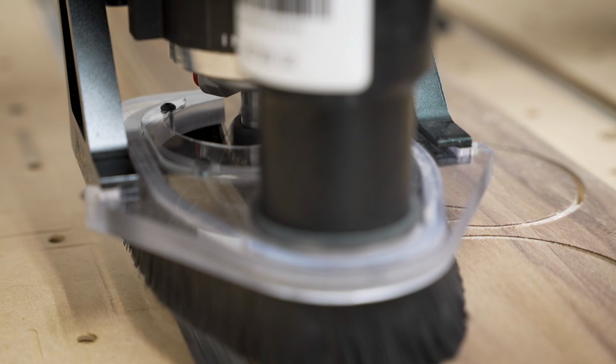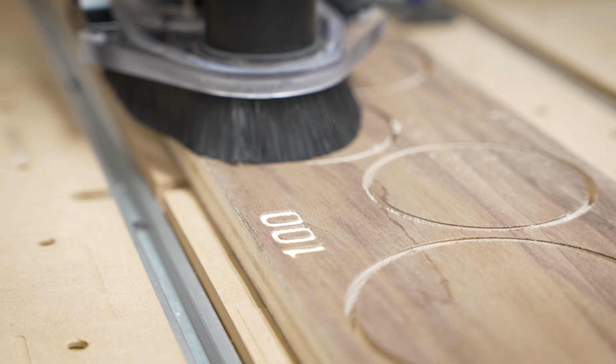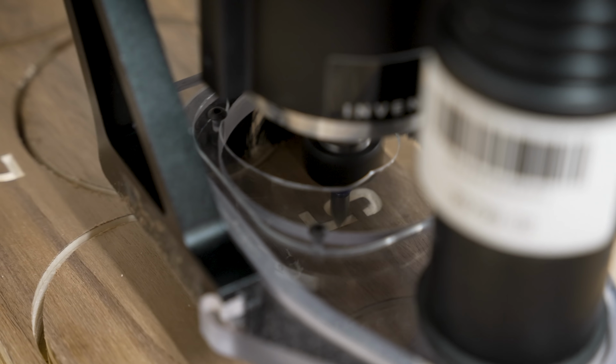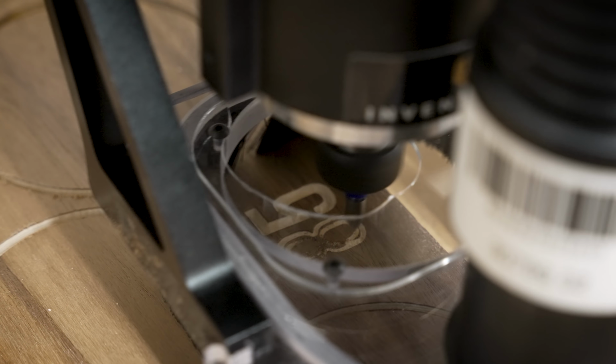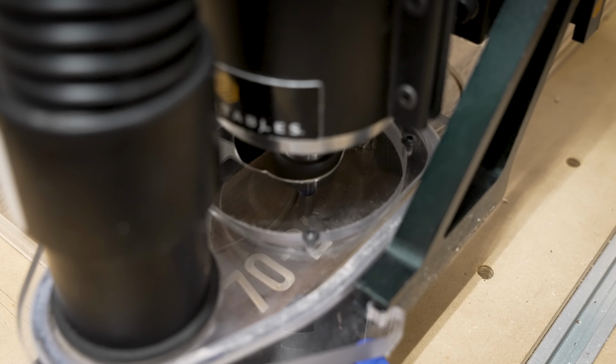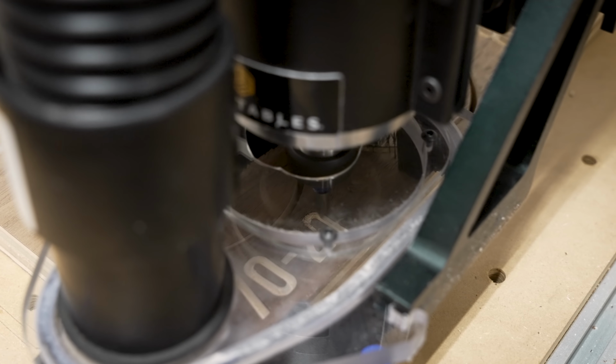Looking better. Thankfully, there was no need for tears on this second attempt. All of my engravings came out much better. The only explanation that I can come up with for the issues that I had on my first attempt was that I just didn't zero the machine properly. So if there's any takeaway here, it's probably that you should really take your time on that step.